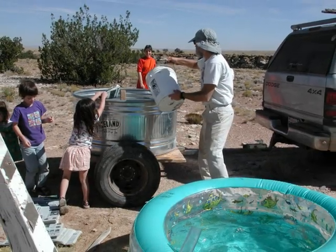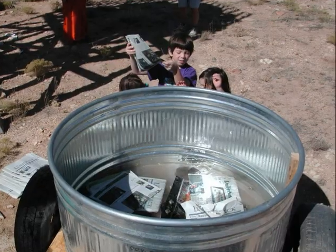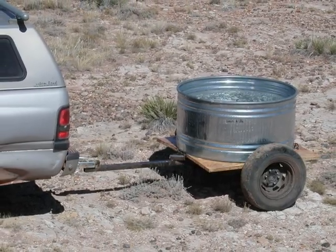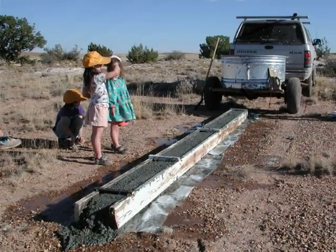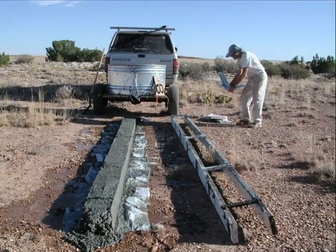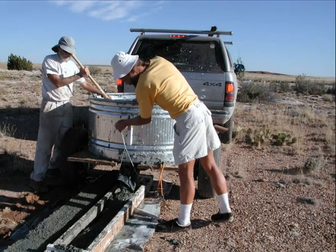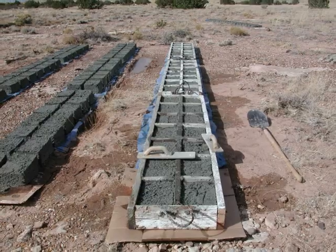Now for the test. We toss in some water and a bit of paper — maybe a bit more than that. This was our first and last test without a cover: it splashes and splatters. We made a simple one long block mold and drove over it, dispensing mix with the spout — it worked great. I cut this block later with a machete to make individual blocks. We still had half a batch, so we let the first pour settle, moved the mold, and got ready for the next trip. The bottom of the mixer is flat, so the last bit of mix has to be pushed to the hole to fall out. All of the next batches we made using three gang molds — one batch exactly fills all three molds in one pass, 42 blocks.